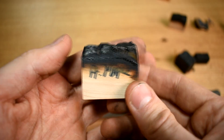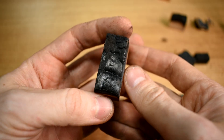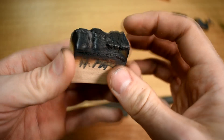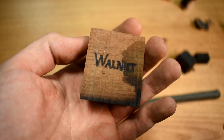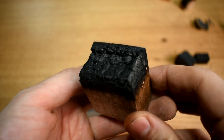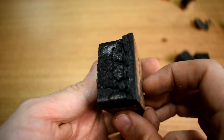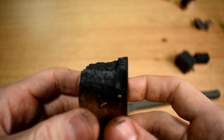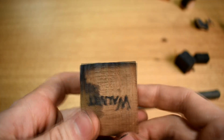Before we get to the craziness of the bronze, let's look at some wood results. I'll do these in reverse order, starting with the worst performing. We have hard maple and walnut — they're kind of tied for worst. Now remember, these are ones that could handle aluminum, so they're still better than most wood. The charred surfaces on both are pretty sturdy, but they're both a little crunchy with the fingernail test. Still far from the worst, but they took considerable damage, burning back quite a lot. You can see it especially on the walnut because there was a section under the sand that the metal didn't touch, so you can see just how far back it burned.